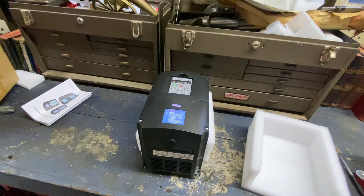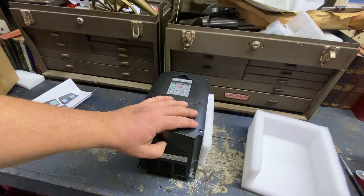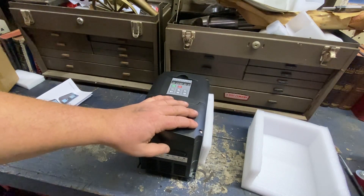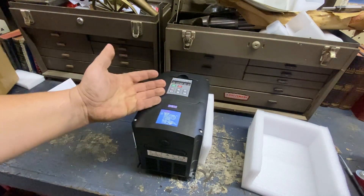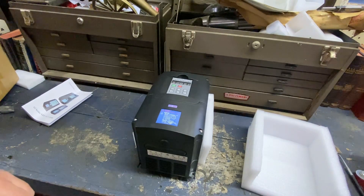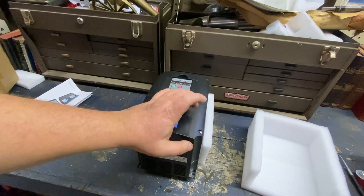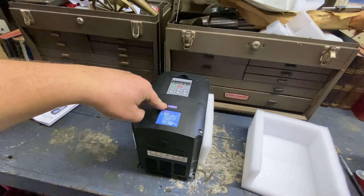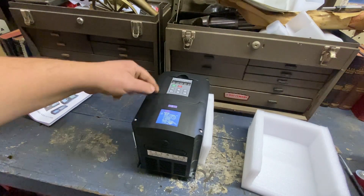This guy needs to handle it because the LeBlanc is at the very extreme of what my rotary phase converter will handle. It does turn it fine, and actually if I run another motor too it runs a little smoother. For how cheap this was, I thought it was worth giving it a try. Even as far as running electrical, because I move my machines so much, I might contemplate — I need a VFD anyway for the big Camelback drill press, because I'm going to run that off a five horse motor, so I could use this for that.